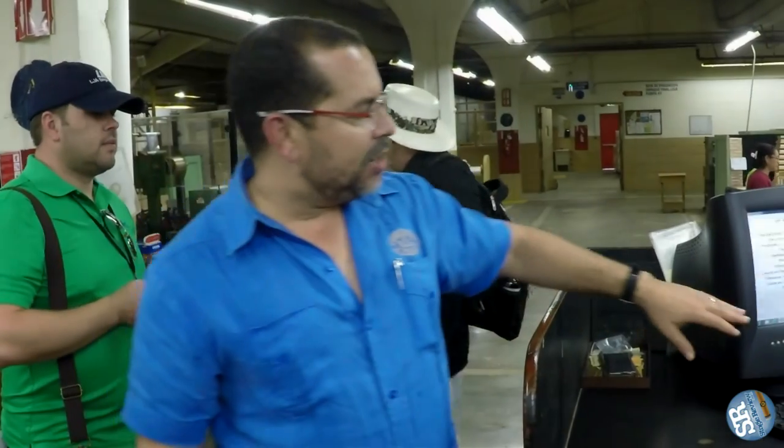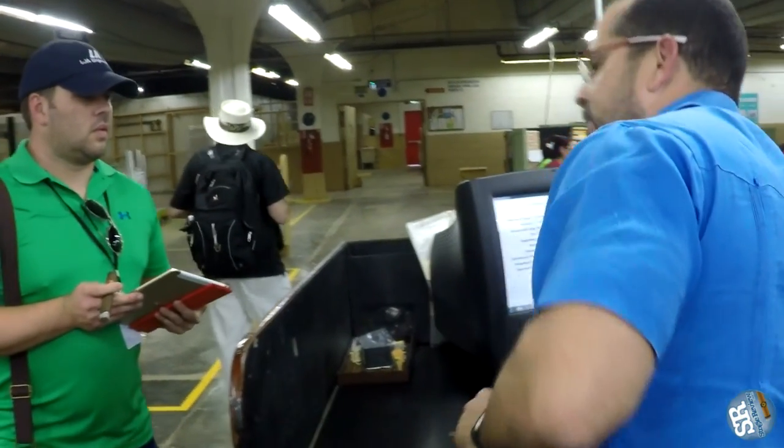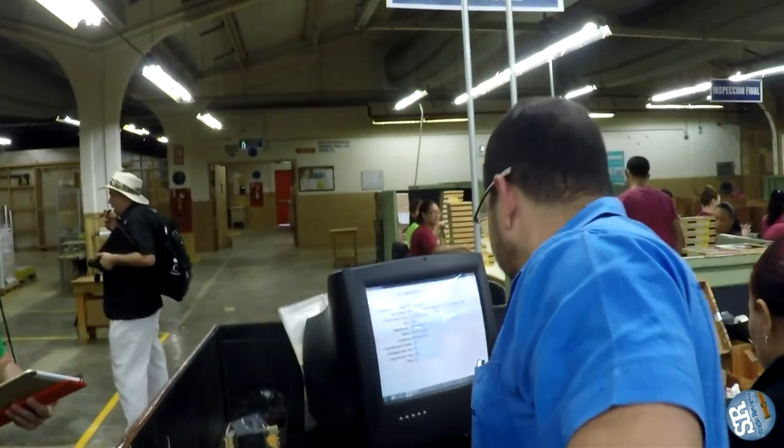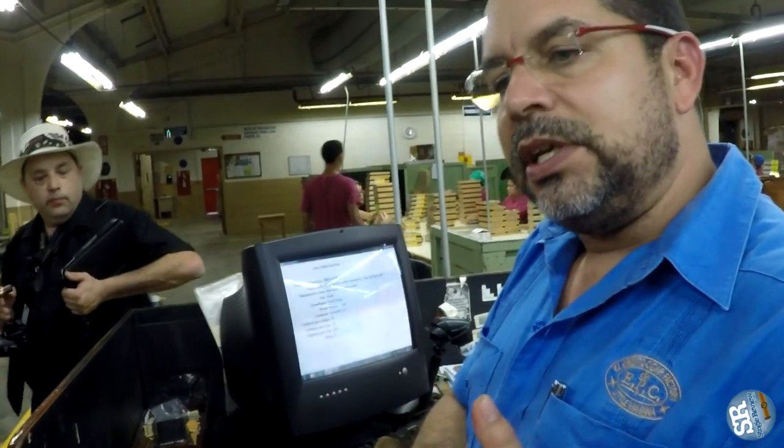We have a lot of variety of different packaging methods — cigars in tin, cigars in cello tube, cigars in crystal tube, cigars in aluminum tube — so we have many product families, and it's not easy to track and maintain consistency. But by doing this lean approach, we improved the process dramatically. Also, since we use UPC on every cigar, we scan some of them randomly to verify we are applying the right UPC and that it can be read — a UPC that cannot be read would mean we'd have products at the store with an unreadable barcode.